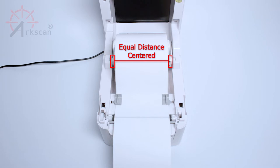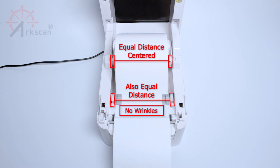If you are using a roll, use the markings on the rod to create an equal distance on each side. Make sure the sliders are also centered using the markings and are not squeezing too tightly on the paper, and check that there are no wrinkles forming. If there are, smooth out the paper. This is most likely caused by the sliders being too tight.